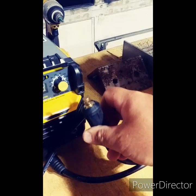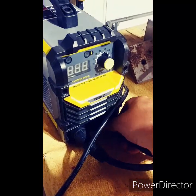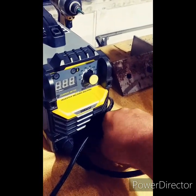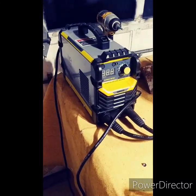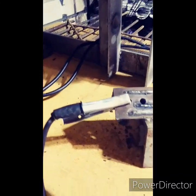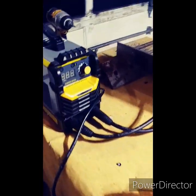Back over to the machine — we have these nice DIN connectors. They are reversible as well. If you're looking to get a nice deep weld on a 6010 rod, you do a reverse polarity and it digs in pretty nice.